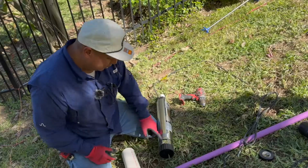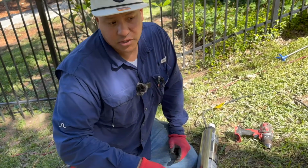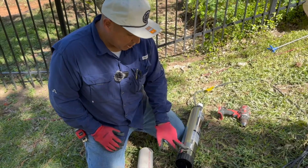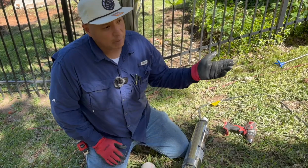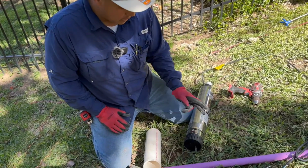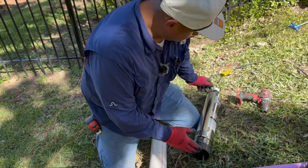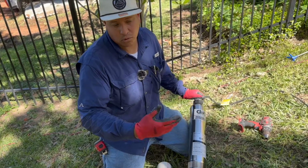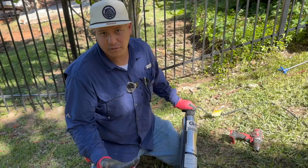Now this Aider is a bottom suction. Depending on the system, the engineer or the designer can specify either a bottom suction pump or a mid suction pump. For this application, they specified a 1/2 horsepower 20 series bottom suction. As I mentioned earlier, in the pump tank, regardless of whether it's conventional or gravity, LPD, LPP, or an aerobic, you're always going to have settlements.